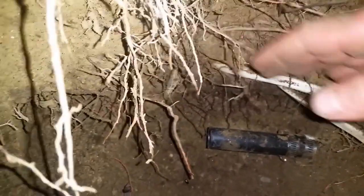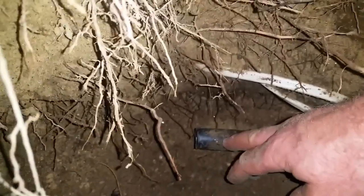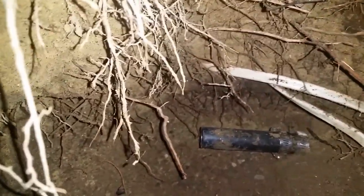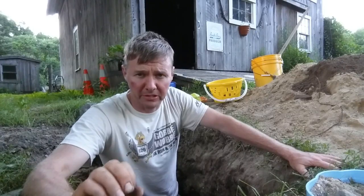A really good idea when burying line is to either put it in conduit or put a piece of wood down over it after you put it in. I was digging this out with a shovel and feel fortunate I came in carefully with a crowbar for fine-tuning — I actually had the crowbar on what I thought was a root but was actually a power line. If you're putting lines underground, be mindful of that. Also, you should know what valves turn water on and off to all the systems in your house — take the time to figure that out.